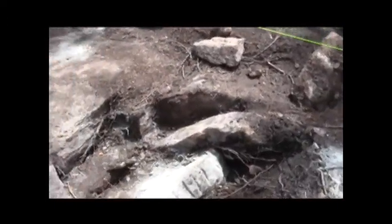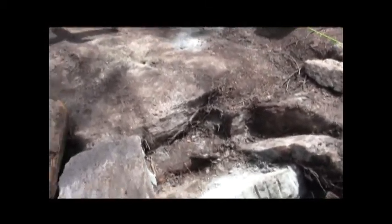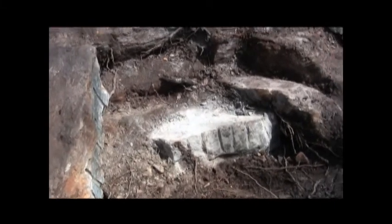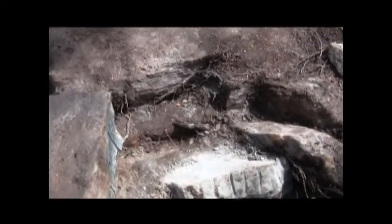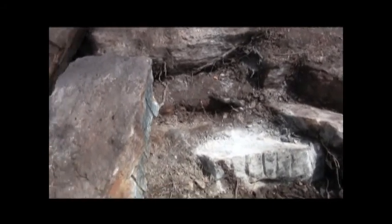There are actually a couple rocks here that still need to be pulled out — I just ran out of steam. I tried to break this rock up because it was moving, using feathers and shims. I drilled holes — you can see there — and used feathers and shims to break the rock. That's a lot harder than it sounds, and I had to drill those holes about two inches on center or else it just broke wrong.